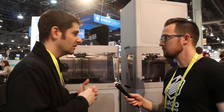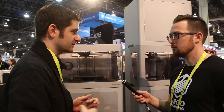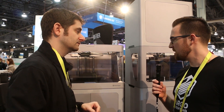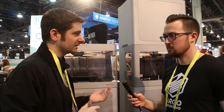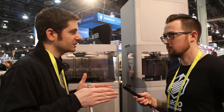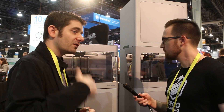Because it's cloud connected, let's say you're doing your first part and want to iterate on the design, or you've made 200 of these in a factory in Shanghai making tools and fixtures and want to make sure everything's still in spec — you can do that online. If something shows up mid-print that's not in spec, you cancel the print, make adjustments in CAD, and move from there. Think of it like CNC machining — your nozzle can wear slightly or plastic can be a little wet, and this allows you to correct that variation partway through the print.